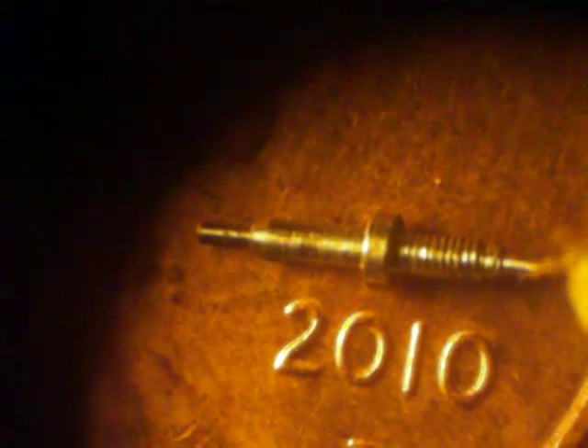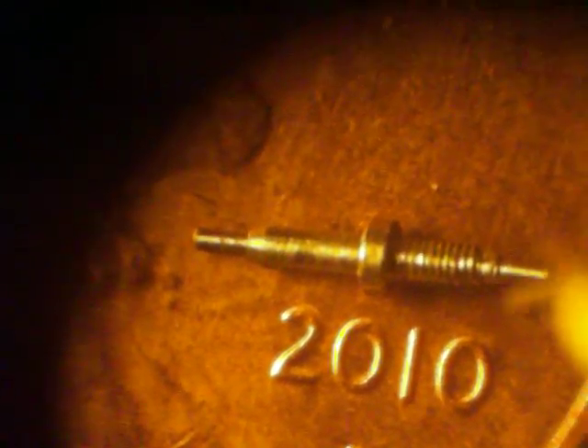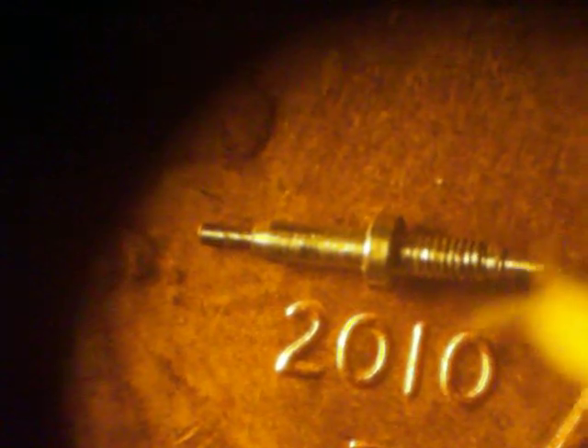I had some difficulty in parting it off. The end with the threads, this end, was the tailstock end. What I did is I cut down a little bit, probably to about 5 thousandths. The pivot's 10 thousandths — I cut to about 5 thousandths, came over to this side, and started to cut my pivot to length, got it down to about 5 thousandths. And by that time, the tailstock end had broken free.